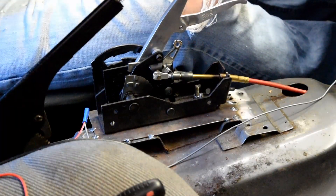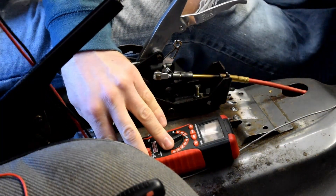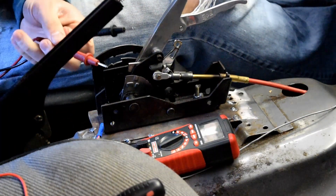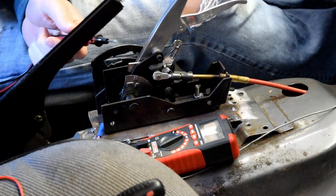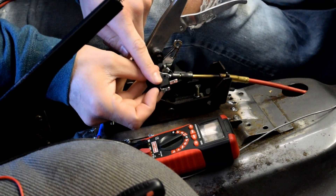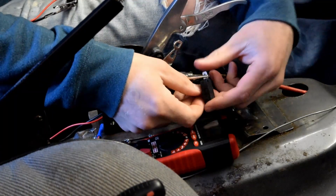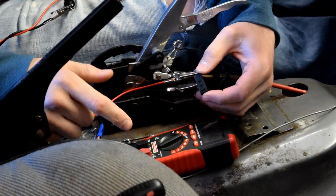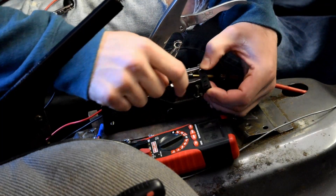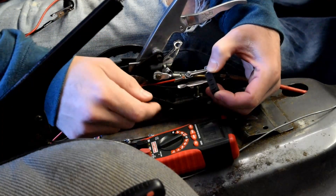Now I'm going to show you how to install, but before I do that, I'm going to take a multimeter and put it on continuity mode — so when you short it out, it makes a noise. If we take the little micro switch and add a couple of alligator clip wires, I'll show you how this switch works. The clips are installed, and that's not making any noise right now, but if you press this button, you'll connect the contacts in the switch and create a circuit.